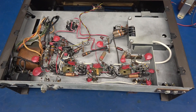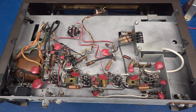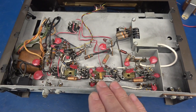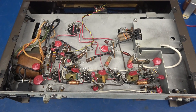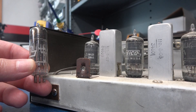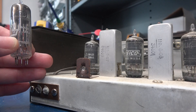Here's the bottom side of the tuner — not a whole lot going on there. So the first step is to gut this thing out, get the transformers landed. I'm going to have to reseat the two output sockets so that 6AQ5s will clear the cabinet, and we'll start building her up. Here is a 6X4 tube — it has the same dimensions as a 6AQ5, and that's what I plan to use for the output tubes in this little retrofit creation.